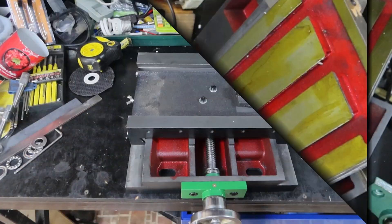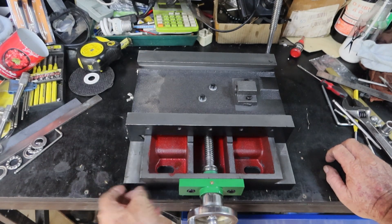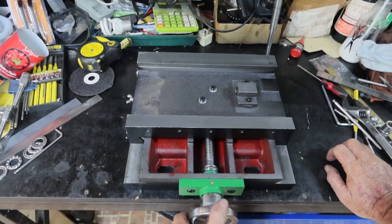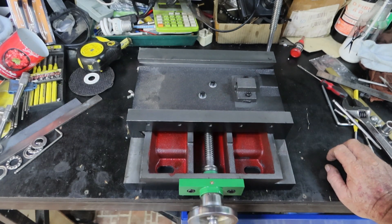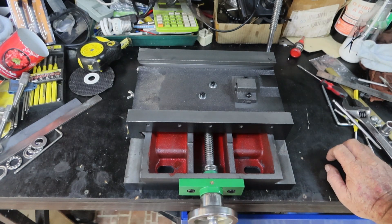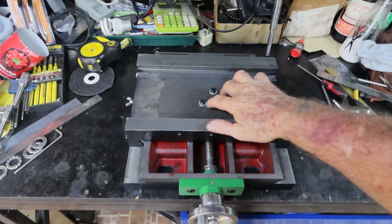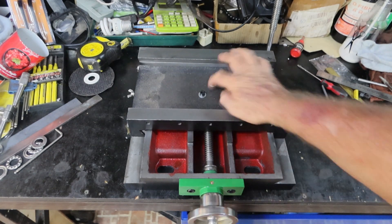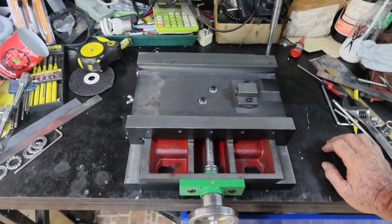While you guys weren't looking this morning, I've cleaned all the burrs on this and given some of it a coat of paint — sparkling black on the base, because I don't have much of the green left and neither of the local stores had any. All the bearings are greased up and oiled. Is this the same table? Look — there's hardly any play in that at all now, compared to what was there before. That's just using that cleaned-up steel gib. The bit of brass I ordered still hasn't been shipped, but with this nut tightened up in place and lock-nutted in there, they've got about 8mm holes in there for two 6mm bolts. I've been running it all the way forward and all the way back to make sure the nut was in the right spot — gets a little bit tight right at the very back and at the very front as you're running out of travel.